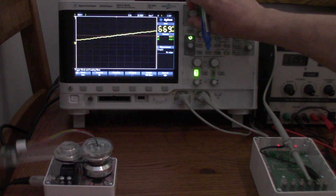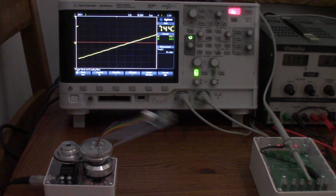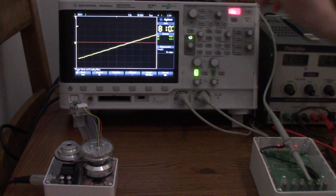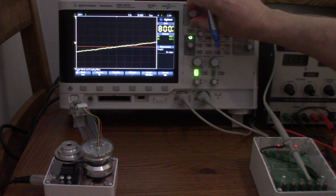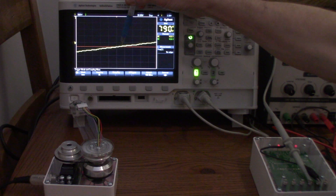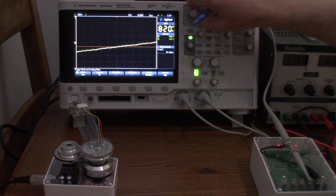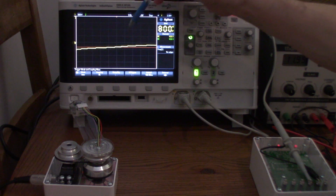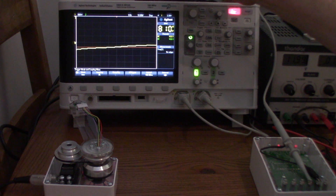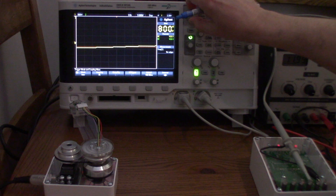Let's look at this in a bit more detail now that we're here. I'm putting this on a single shot and stopping the compass to capture the waveform. What I'm interested in is the stepped waveform visible here — these steps are the times the software is taking to extract the compass data. Opening this right out you can see this stepped edge clearly, and it varies quite significantly due to maths processing and timing.